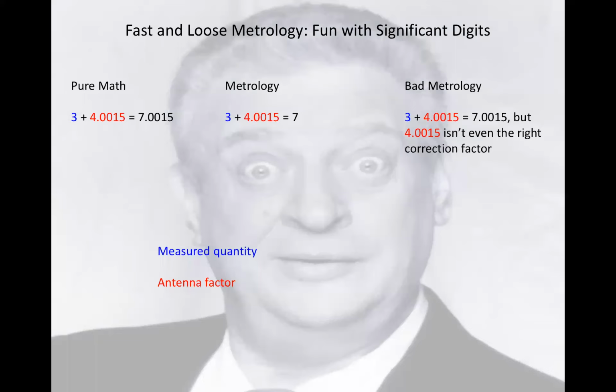Well, I think a big part of it is, and I don't want to turn this into a CISPR 25 bashing fest, but a lot of work in recent years has been done by people supporting CISPR 25, where they've gone around and done round-robin tests between different facilities to see what kind of repeatability they have, right? Yeah. And sometimes they get pretty good, and sometimes they don't. But a lot of that goes into, I mean, these are really expensive chambers. If you compare what you guys do to make a room meet requirements versus a mil standard room, you guys are spending a bunch more money, which is understandable. There's good economic reasons for that.